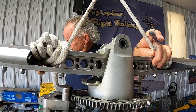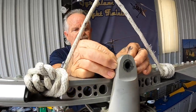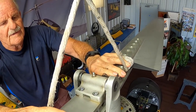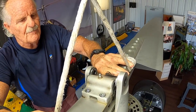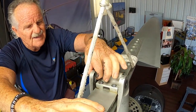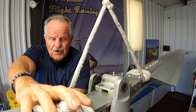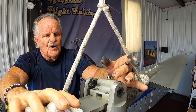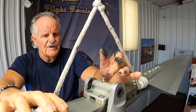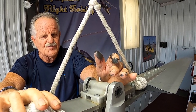Remove the teeter bolt, and now you will remove the two spacers. There are aluminum spacers in here that you want to remove. Just slide the hub bar back or forth and remove the little spacers — there are two spacers, one on either side. We'll later explain the installation and selection of these spacers to address wear. After about 100 hours, these spacers will wear thinner and allow the hub bar to slot back and forth minutely, which creates some shake in the cyclic.